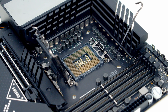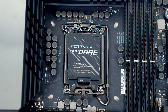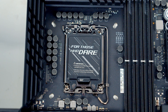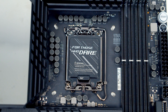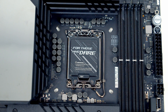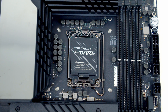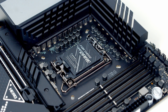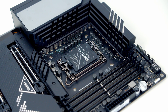In the middle of the motherboard we've got the new LGA 1700 socket and mounting holes. One of the really cool things ASUS is doing with their Z690 motherboards is that there are two separate mounting holes — one for the new LGA 1700 standard and one for backward compatibility with LGA 1200, meaning you can use an existing LGA 1200 cooler without needing an additional bracket. The motherboard features 20+1 power stages with large heatsinks over the VRM.